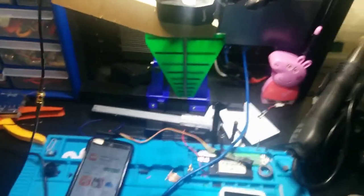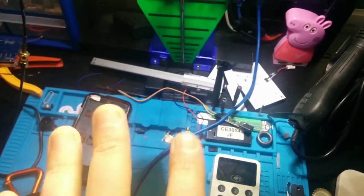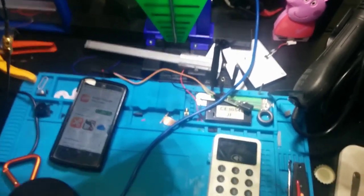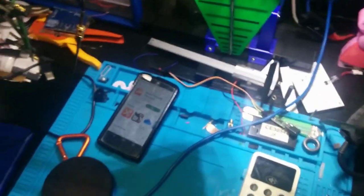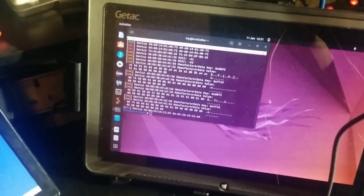I've got a directional ultra-wideband antenna which nicely centres around between 2.2 and 3 GHz, so that's perfect for this, being 2.4 GHz Bluetooth. Over here I've got my field tablet - that's just going to be running the HCI tool or Kismet, I'm not too sure yet. It's currently running HCI control capture, and then obviously everything else that's going on.